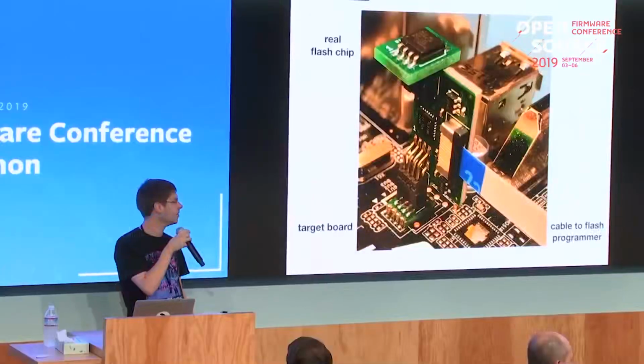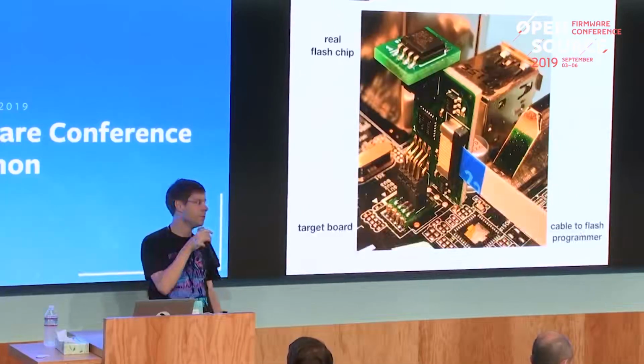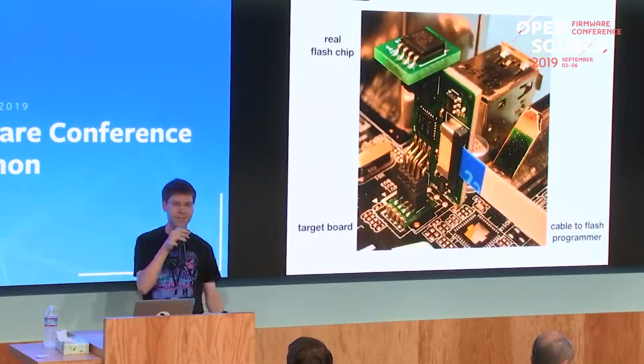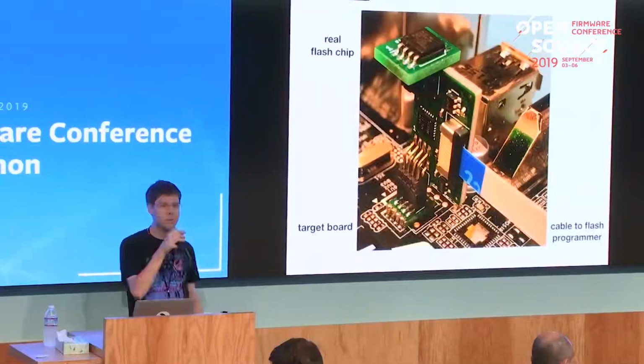And basically that was really hard to manufacture, because when you put that through a pick and place machine and a soldering machine, you can't really glue the parts on the bottom side to the board, because they don't have that much area where you could put the glue. And so they're relatively heavy compared to the area where the connector is soldered on the board. So basically, the problem is when you put it through the soldering process the second time, the parts on the bottom side are very likely to fall off. So I had to do that redesign with components on just one layer.